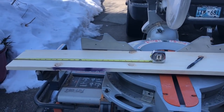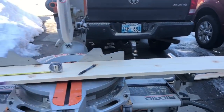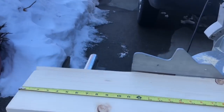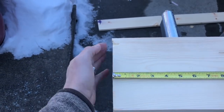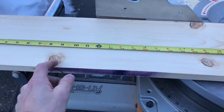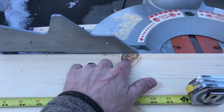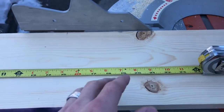We're back at the house and I'm going to start cutting lumber. I'm going to start off with one of the supers. This is a one by eight and we're going to cut it down to lengths. We're going to true up the board — notice there's some damage here and the cut is a little bit off. Go through your wood and look at where your knots are. You don't want any knots where they're going to be on the top or bottom of each box.